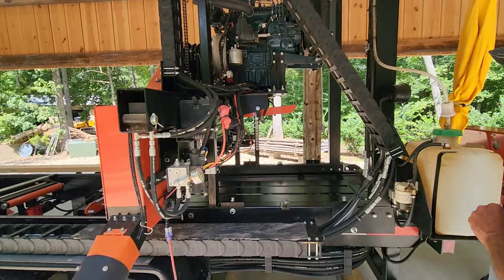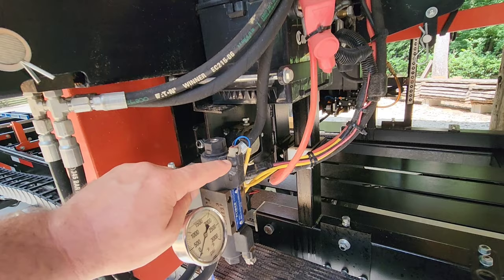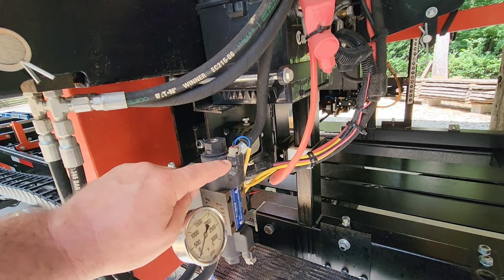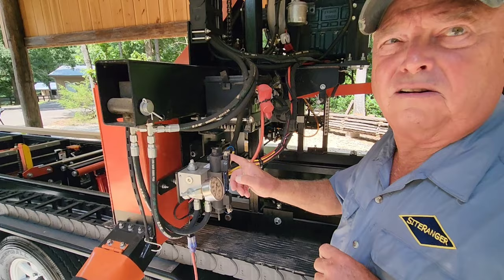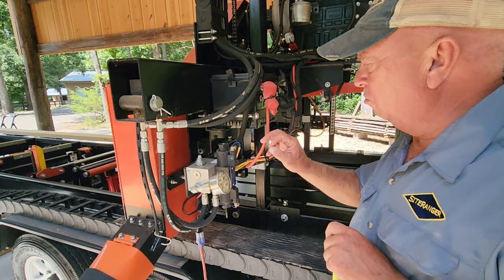You did take my advice on one thing — around this solenoid right here. There's a solenoid valve right here. You added silicone grease to not allow fine sawdust — such as cedar sawdust — to get in here. If you lose connection there, it'll cause your computerized setworks not to work as well. That silicone is on the outside, not jammed or full inside. That can sometimes be a problem when we're talking about millivolts and milliamps.